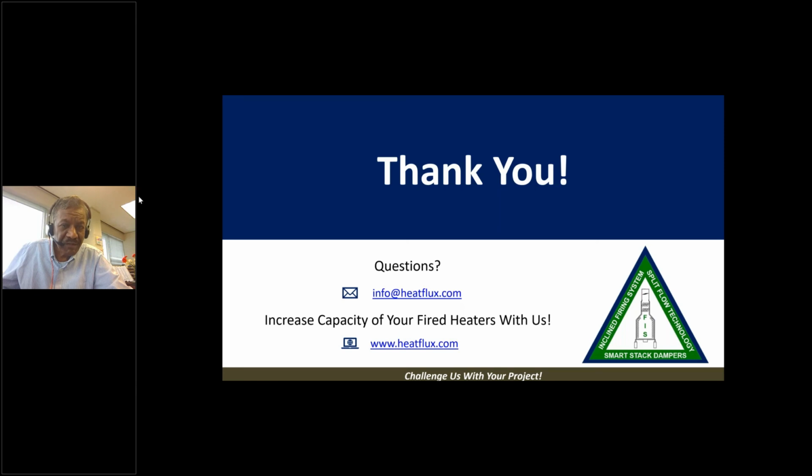So how does the split flow technology affect the draft? No, it does not affect the heater draft. I think we make sure that your heater has sufficient draft, as before. So your firing rate, you are not draft limited after split flow, and you have plenty of air and plenty of fuel you can fire still.